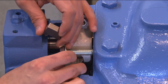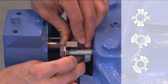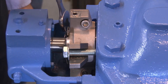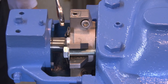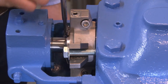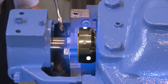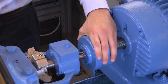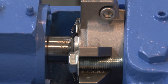Install the adjustable gland tabs as needed for a 2, 3, or 4 bolt pattern. Evenly snug the mounting bolts to the stuffing box, keeping the seal perpendicular to the shaft. Do not over-tighten the bolts. No centering of the 442C cartridge split seal is required — the internal centering buttons will center the seal automatically. Rotate the shaft by hand to make sure that there is no metal-to-metal contact within the seal. A slight drag may be found due to the seal faces, but the shaft should rotate freely.